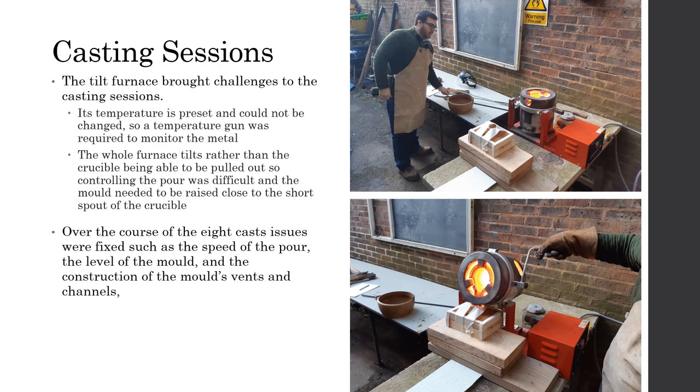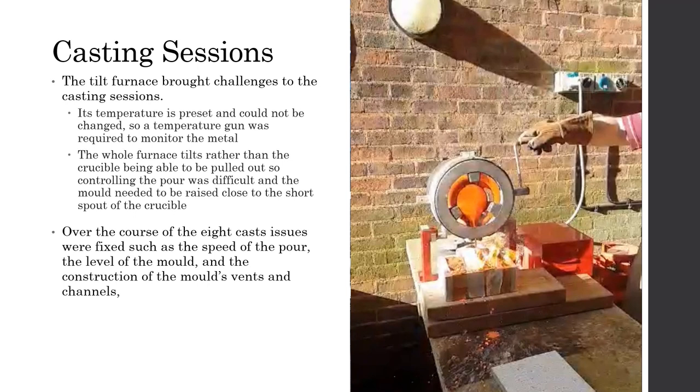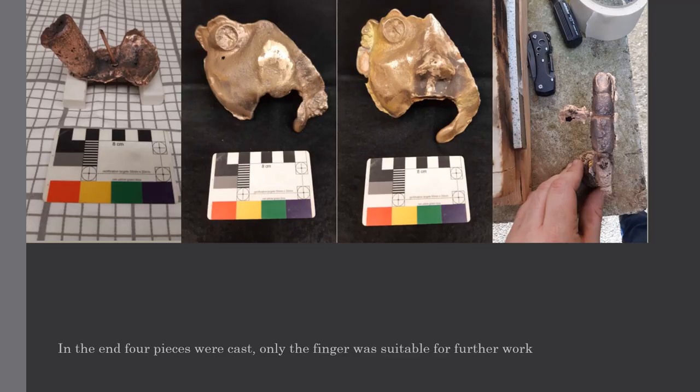As the crucible is heavy and you have to pour from the side, it is hard to judge how quickly the material was moving. During the cast of a pair of copper lips, molten copper began to jump out of the ceramic funnel and it took a second to stop the material from pouring out. I believe the air vent was located too close to the spout and the heated air escaping the mold pushed on the molten metal as it poured and caused the material to jump back out of the funnel. Constructing the mold took several tries to get right. If the funnel and channel were not placed close to the edge, the short spout of the crucible would not reach it, and if the channel and gas hole were not oriented well, the metal would not flow properly in the mold and would not travel fully through it.